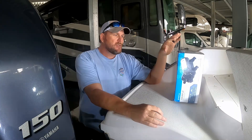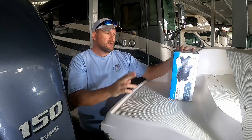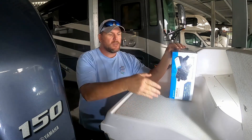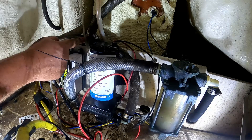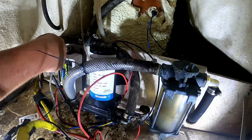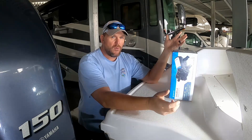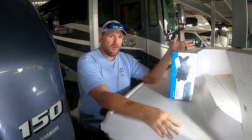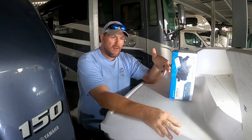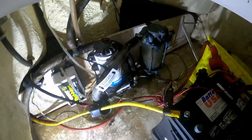This is technically a wash-down pump — a high-flow wash-down pump — and it's not a designated live well pump, because this pump does both. It does live well and wash down. One outlet goes to the live well, one goes to the wash down. The way you operate it is one valve is open and one is closed, and you switch back and forth. There's not a three-way lever; it's just one valve on each end. With the wash-down valve closed, the live well runs, and vice versa.